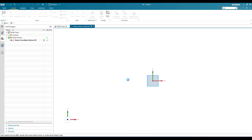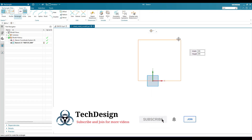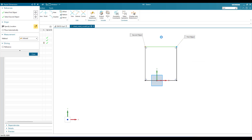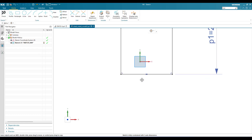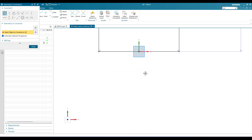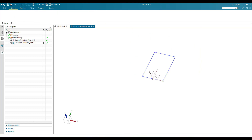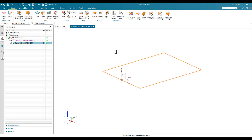On this particular plane I'm going to draw a simple rectangle. Let me make a dimension for this — it is 150 mm and 200 mm. The center point should lie on this point, so press C and select coincide so these two points are the same. Now our sketch is fully constrained, so we can finish the sketch.